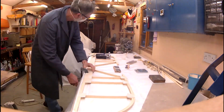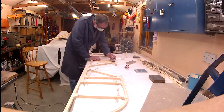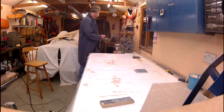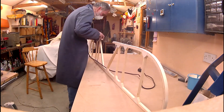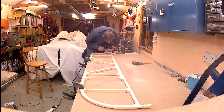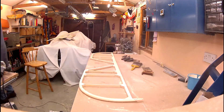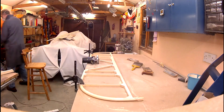Now all dried. I'm going around with this edge router just removing the excess from the gussets to bring everything back to the frame, then doing a little bit of sanding to get rid of the edges. Clearing up the workbench before I do the edges of the elevator. Changing the routing bit and setting it up. Here I am using the round-over bit, just cutting back the initial cut for making a semi-circle around the trailing edge, cutting off the excess, sanding it flat against the other piece. And now I'm using a 45 degree bit just to cut into the V in the elevators there, and we'll talk about that in a bit more detail shortly.